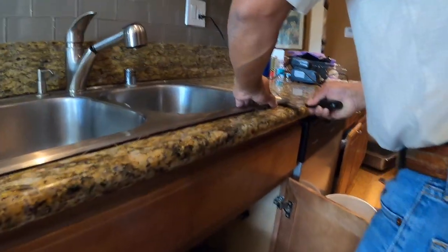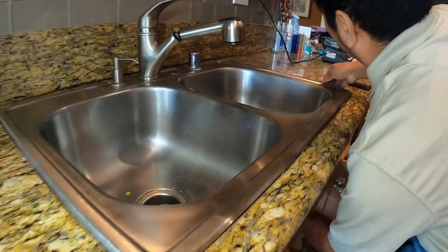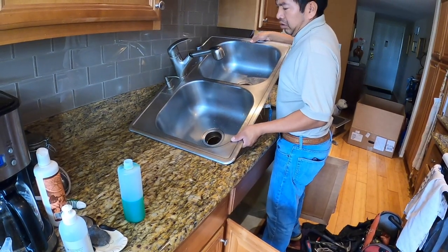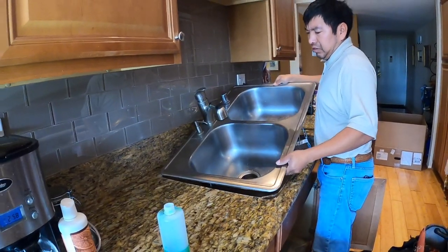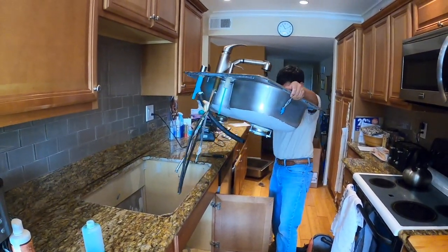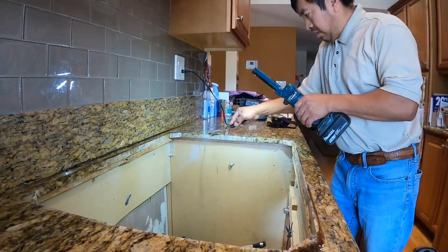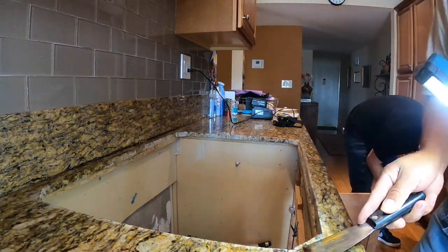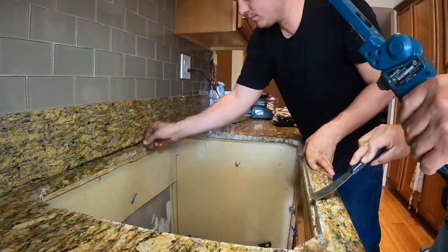Now that I've got all those wires cut out, I'm going to take a putty knife and just pry this sink gently apart from the silicone that it's attached to on the countertop. My helper Simeone is helping me today and he's just going to carefully remove that thing — making sure all that plumbing is already disconnected. We will remove that one and clean up the countertop in preparation for the new install. There's a bunch of silicone to scrape away — we start with the putty knife, then clean it up with a rag, then go back with a utility blade.